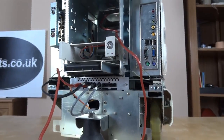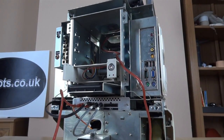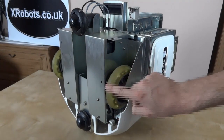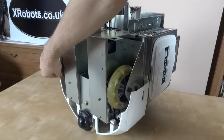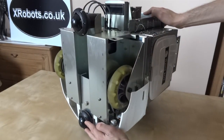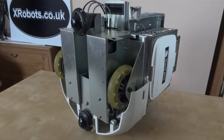The robot is mostly made of steel — in fact I think it's all steel construction. And it was actually made in a factory in Canada which generally makes medical-grade equipment. Looking at the base of the robot, we can see the two main drive wheels. Those are driven by two stepper motors controlled by the M3 board. We also have two ball casters at the back and front, and the front one is on a suspension arm so that it can go over lumps and bumps without getting grounded.